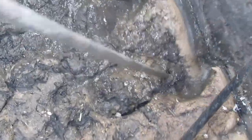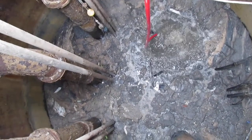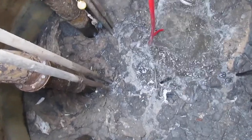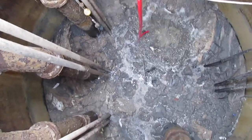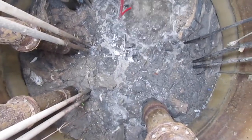The following is a video of a wizard installation showing the agitation and water quality effects of the wet well wizard. Note how the cutting action of the slicing tool segments the fog cap. Imagine the bottom of the cap, where slices in the cap are exposed, where the wizard bubbles will enter. Within the first 15 minutes, the bubble action of the wizard has not only broken through the 12-inch fog cap, but it is causing the slices made by the cutting tool to break up.